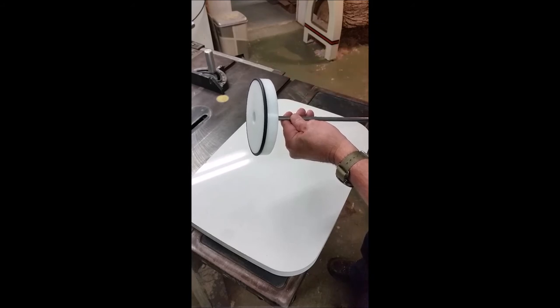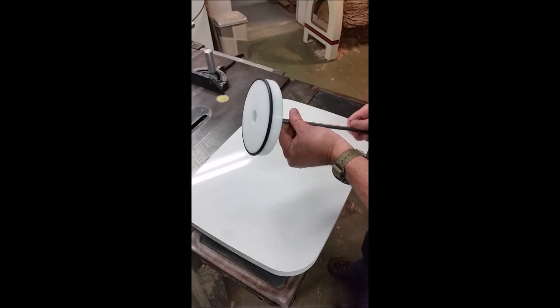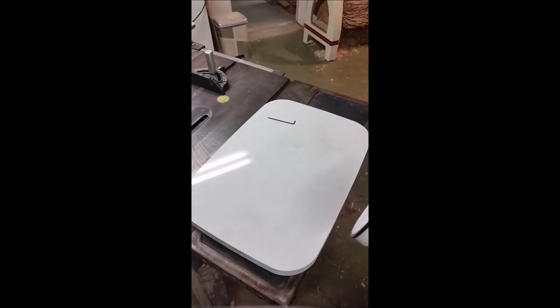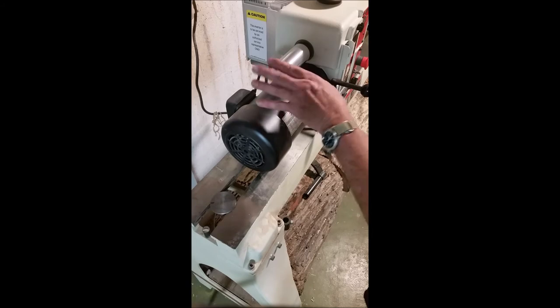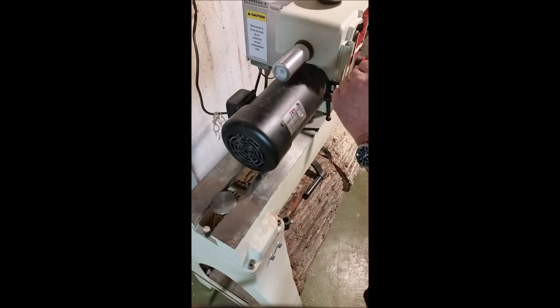The chuck face itself was machined on that lathe so it doesn't have a great deal of run out. The only thing about the lathe itself that I changed at all was inside the handle I put a UHMW bushing that is just very slightly larger than three-eighths of an inch. That keeps the tube from flopping around and drooping down, preventing too much stress on that tiny little bearing. The bearing is basically used as a rotary union and not really as a bearing as such.